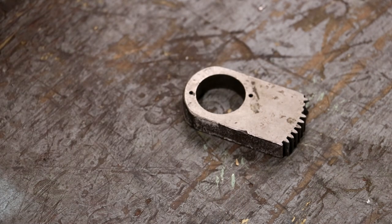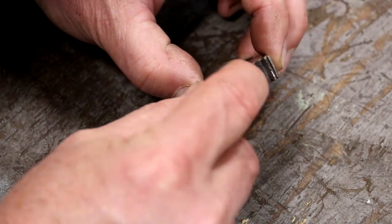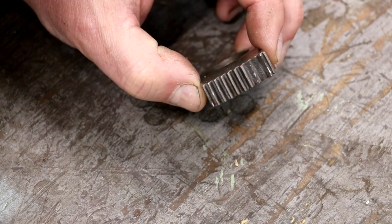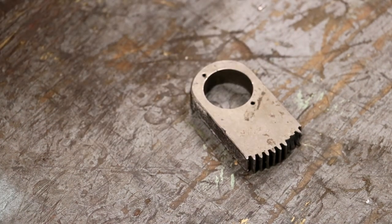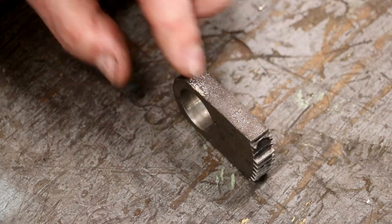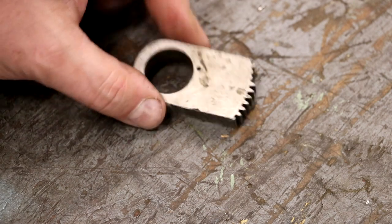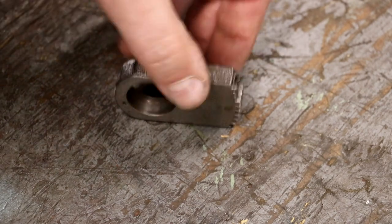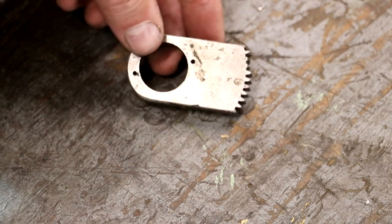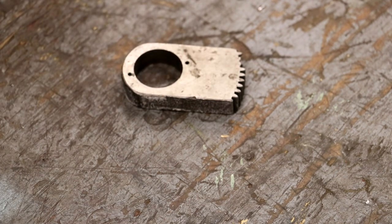A couple of observations about this. First thing is what material was this originally made from, and it's pretty easy to determine. In this case it's cast iron — I can tell because looking at the broken teeth you can see the grain of the cast iron. Cast iron is a little bit grainy and looks different than steel on a break like that. But an even bigger giveaway is the sides of this — it's all rough casting. I suspect that Monarch was casting these in a long shape and just sawing off little pieces. The outside three sides were left as rough casting; all they needed machined was the gear segment and the hole.